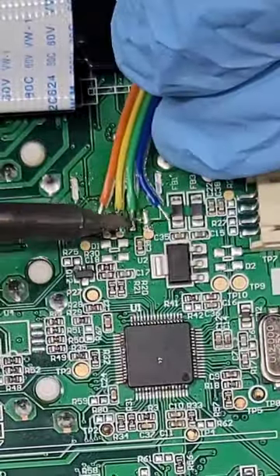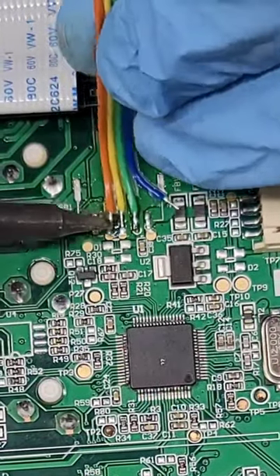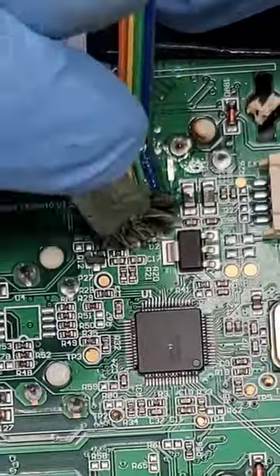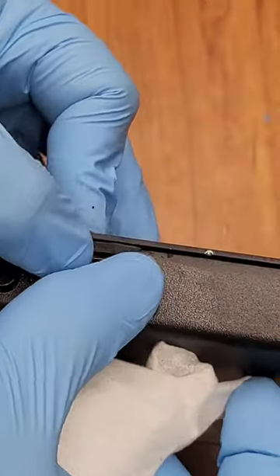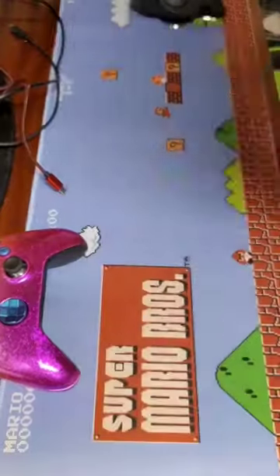Since this is an older keyboard, the second USB plug on it is meant for 2.0 ports. It's not USB pass-through, but since we're on USB 3.0, we don't need it for this mod, and we should be fine with just one USB-C female port.